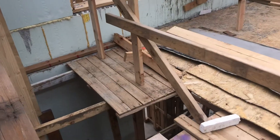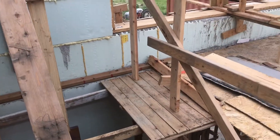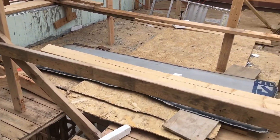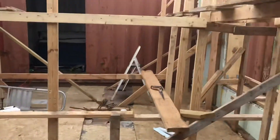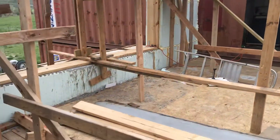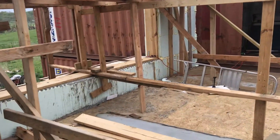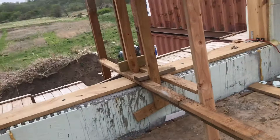I have some final touches to do. Like I said in my previous video, my floor was going to be just a temporary platform, which is what I did. I used all the wood I had left from previous projects to build the platform so I can go up. I did not need to have the final floor or the floor trusses here in order to do this, so I didn't think going out and buying that kind of lumber now would do me justice financially. I decided to just erect the structure from the bottom to support the floor here, to give me some space, a platform, and the safety to work.